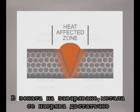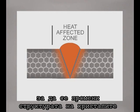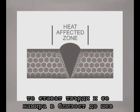In welding, the metal adjacent to the weld bead becomes hot enough to change the structure of the grains. Because only a relatively small area is heated, the metal cools quickly, forming smaller grains and becoming harder right alongside the weld.